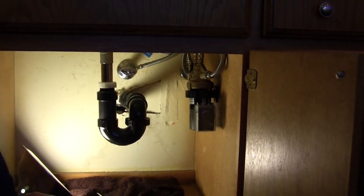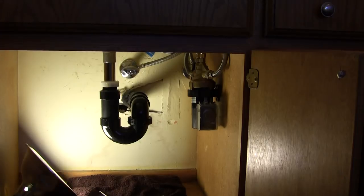I'm going to plug it in and we're going to circulate it and get some instant hot water. Now, to set the controls to fit your lifestyle — one would say, why should I set controls? Why not just let it run all the time? If you intermittently use water 24 hours a day, then you have the pump run all the time and it will thermostatically run when it needs to keep the pipe warm, and once it's warm it'll thermostatically shut off to save energy. But if you're not there all day, you don't need the heat loss occurring and you don't need the pump running. So for the sake of efficiency, set the controls to meet your lifestyle.